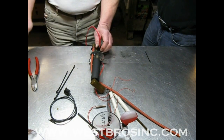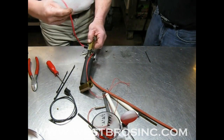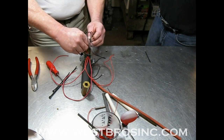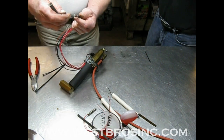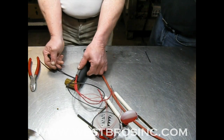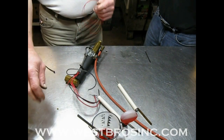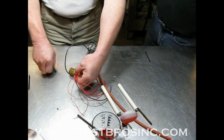Note that the new nozzle temp control with the red wires goes closest to the orange compressed air inlet tubing. Be sure to reinstall the high temp wire shielding. Do not use any lubrication or sealant on the small cartridge heaters at all — dry only.